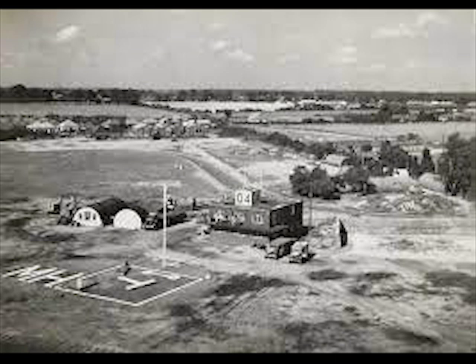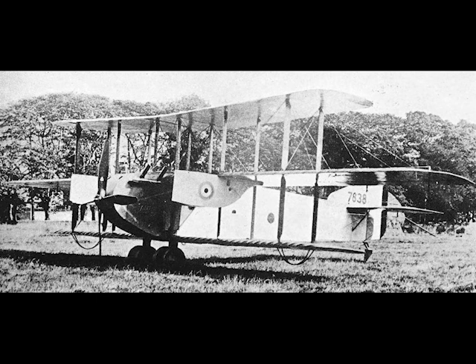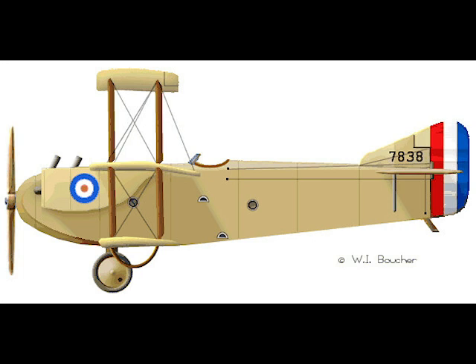The aircraft's numbers disappear from the record in early November. Martlesham Heath was aware in mid-May 1916 that the Armstrong Whitworth triplane was being reconstructed — almost certainly a reference to the revised design. The revised triplane was originally intended to have a span of only 41 feet, a length of 30 feet 3 inches, and a height of 13 feet 4 inches, suggesting it was conceived as little more than a long-range version of the original. In modified form, a speed of 100 mph at 6,000 feet was expected, with fuel for six hours; estimated climb to that height was 11 minutes. Official notes state only two aircraft were to be built, and it seems only one was — emerging as a wholly redesigned aircraft.